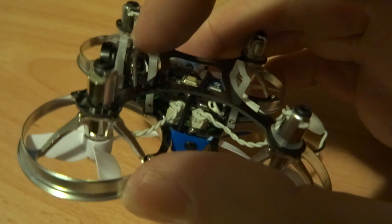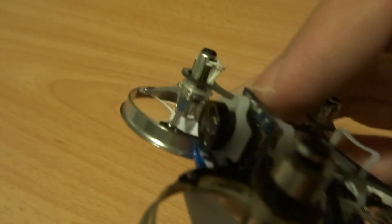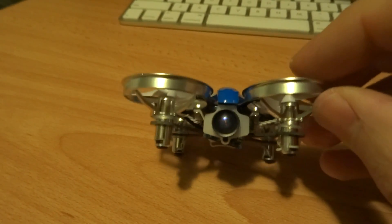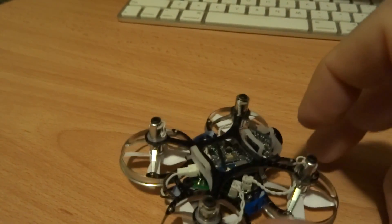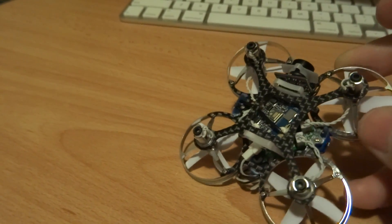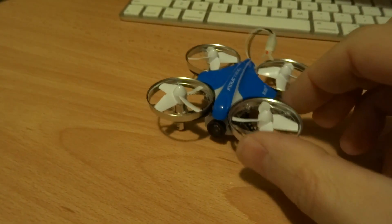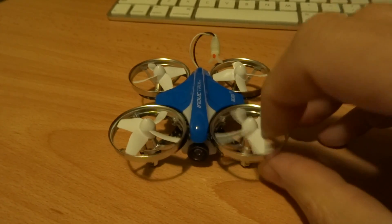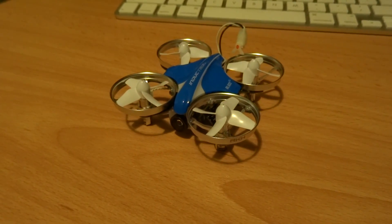Also, when you install the battery it presses directly against the back of the PCB, giving you some up tilt — there's only one screw and two little plastic nubs holding it. I think it looks a lot nicer than the original and should be way stronger. I've gone above and beyond by adding the Makoon Designs carbon plate, so this has a double-decker carbon fiber chassis, aluminum motor pods, aluminum ducting, an under-mount camera, and the stock Inductrix shell. I just need to get it to perform a little better. Thanks for watching — hopefully you learned what you can do to your Inductrix when you break your frame.